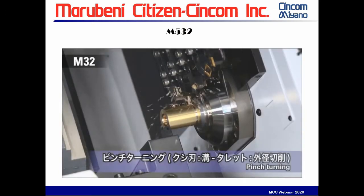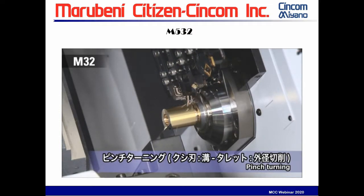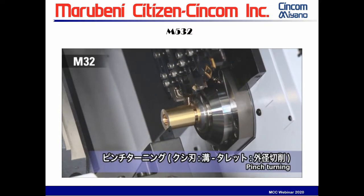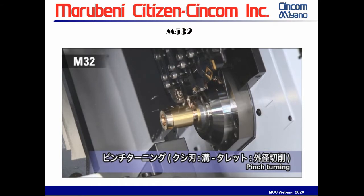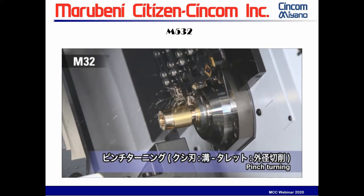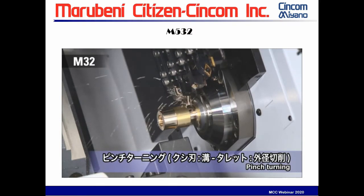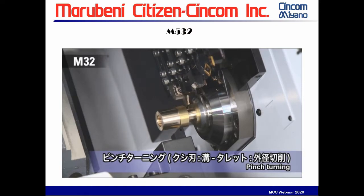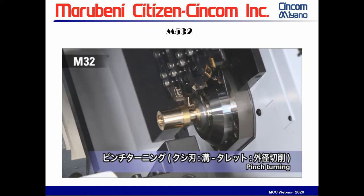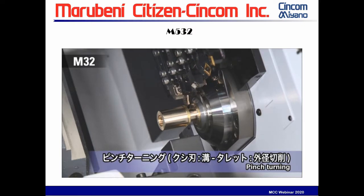Now in this operation, you're going to see two different cutting operations for different feed rates, different speeds. Programmed independent of each other, but with the Cincom software, it makes it very easy to marry up these two cutting operations. Something we call axis superimposition. Talk a little bit more about that later.